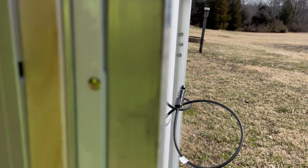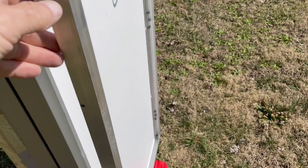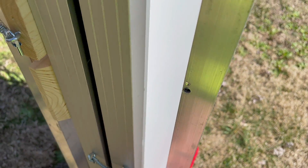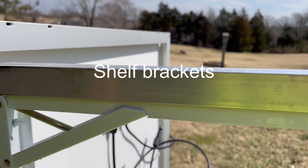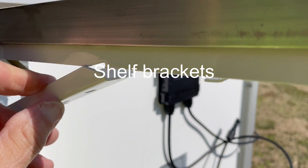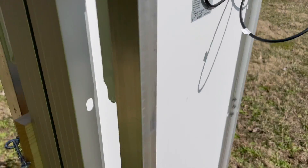Now I'll show you how I built it all. I have a block of wood attached to the frame of the panel here, and then I have a 4 foot pole attached here. I have a little screen door hasp that allows me to lift this out, and then those lock in place. To undo it you just raise it up, slide it down, and then lock it back.